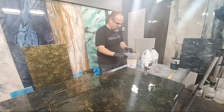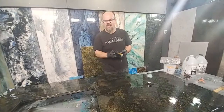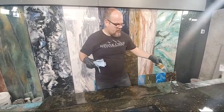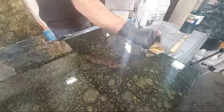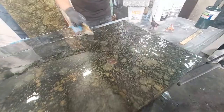This is really simple and fun — it's stress-free. Once you get to this point, you've done all the work. We built these tops in about three hours for the woodworking portion. Let me wipe my brush handle — if I start chopping with a slippy epoxy handle, I'm not going to have a good grip. I like to have paper towels handy, especially before I grab my torch. See how I'm chopping over these edges and then working the field — this doesn't take long, but it is an important step. You won't get any unmixed epoxy if you follow the trowel, brush, and mixing techniques we teach.